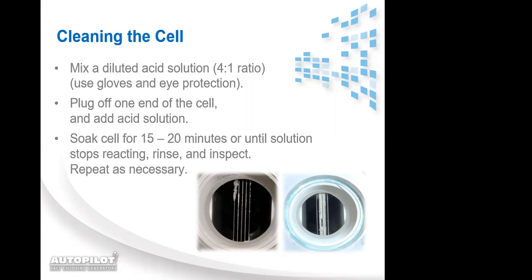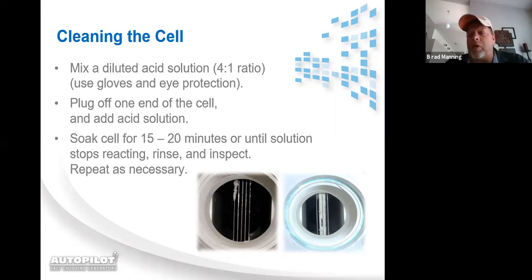Yes. Before we started taking questions, we were talking about scaled cells and how to troubleshoot a check cell, clean cell, or low amp cell message. Once again, I revert back to running the test properly, and when you ran the test, whether you got high volts and low amps or low volts and low amps. High volts and low amps, you're going to always start your troubleshooting at the cell.